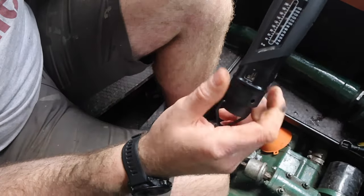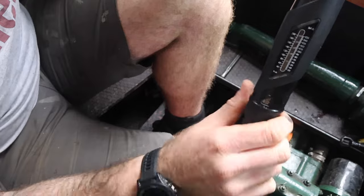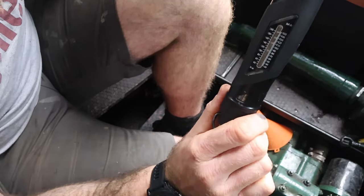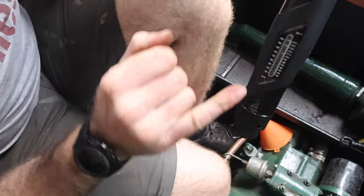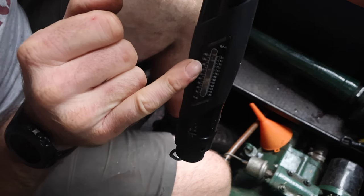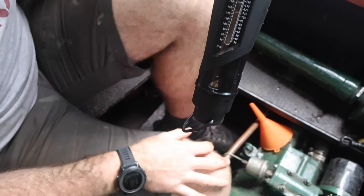The manual says to do them to 120 foot-pounds of torque and I have a feeling I've only done them to 110 — just in case anything did happen further down the line, you know you've got that extra bit you can tighten them up. Whereas if you go straight for the 120 and you've got problems further down the line, well, you're stuffed — you can't really do anything. My old faithful torque wrench packed in, so I had to go and get a new one. Here's my fancy new one. We'll get this set to 110 — you can see the slider moves as I increase it.